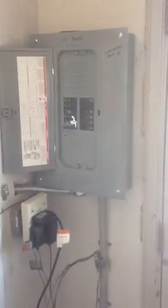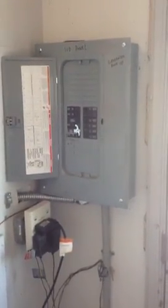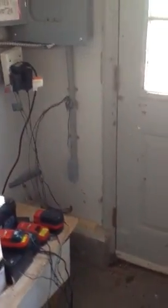I did a sub-panel off my two main electric boxes there and I pulled off the breakers that I felt I needed during a power outage — the well pump, the furnace, refrigerator, a couple outlets, lights, TVs. I've got all the important outlets wired up and I just cut the mains off when I have a power outage and flip a switch so that acts as the main, and the few breakers I've selected work as my backup.